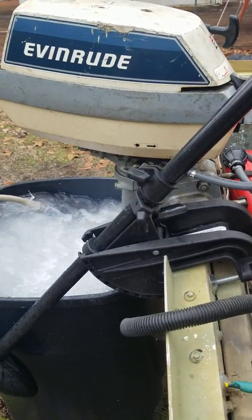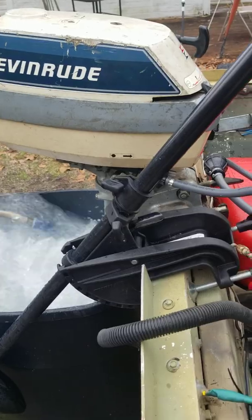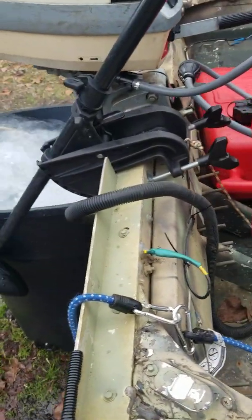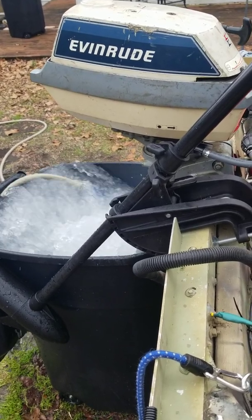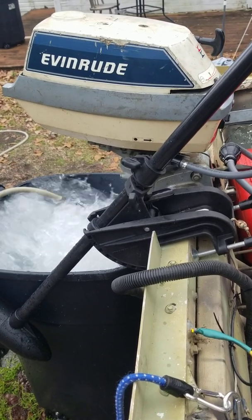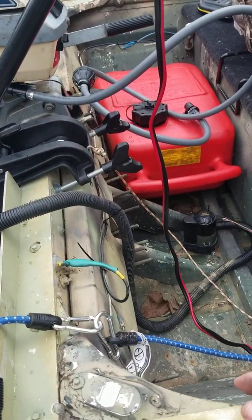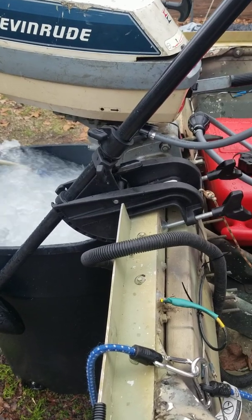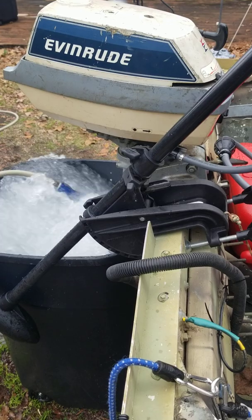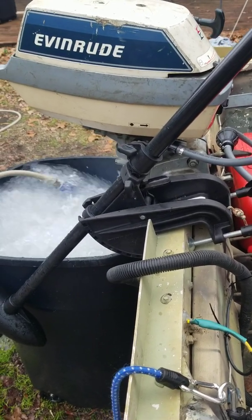Especially with an old motor like this. The boat also came with an Evinrude bow-mount trolling motor. There's a deck built up front, a spotlight for night fishing or duck hunting, and nav lights. Nothing was wired up — the previous owner cut all the wires out and left them balled up, hooking positives to negatives and grounds to positives — everything was crossed and backwards. That's why he got rid of it so cheap: he didn't want to deal with rewiring. But I've got some electrical knowledge from over the years, so I got everything working. The boat even has a DC power outlet that came on it — works fine. He had cut the cables off that too, but I got a great deal.